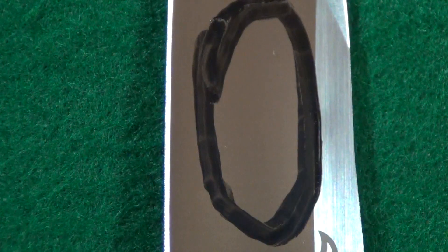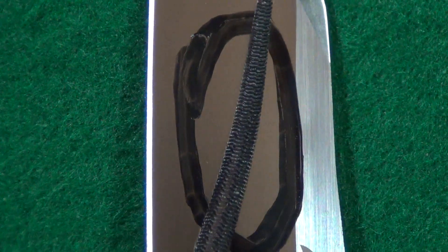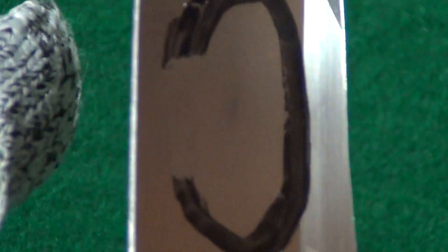Starting with the black one at 65 HRC, I'm going to take that rounded section and try to scratch the blade — because I'm pretty sure this steel is not above 65 HRC. Yep, you see the mark there? It'll make a mark that you should not be able to wipe off. I removed some of the black marker by accident, but the scratch is clearly visible. So we know the steel is softer than 65 HRC.